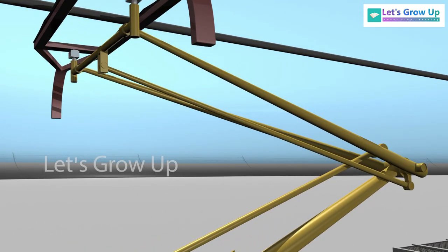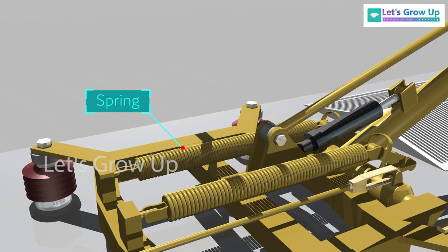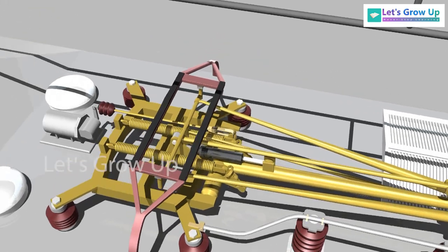The articulated system is designed to allow a maximum extension of 2460 plus zero and minus 20 millimeters. Two springs whose tension always balances the mass of the articulated system, and at the same time raises the pantograph and provides the required contact force of seven kilograms distributed through the bow assembly for satisfactory current collection.